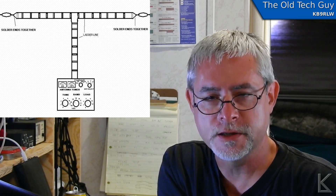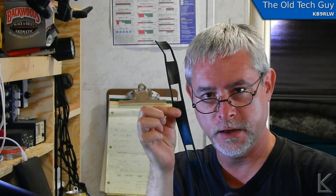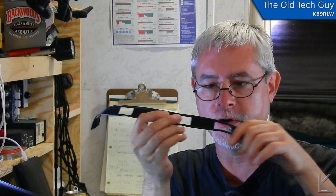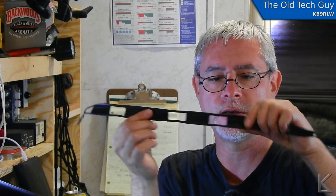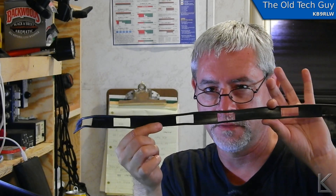It's a fairly classic antenna style or design. They used to use wooden dowels or plastic or ceramic insulators to space the wires. Ladder line or feed line — which you've probably seen — is a good example of that, or even old twin lead like you'd feed from your TV antenna back in the day: parallel conductors held apart with an insulator. I'm going to build mine out of this window line, which is normally used as a feed line. It's a twin lead — two parallel wires spaced apart by this plastic material with holes cut in for reducing material costs.